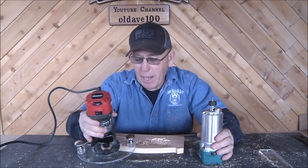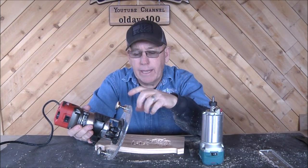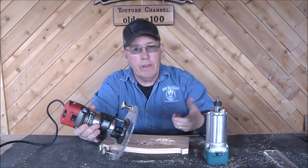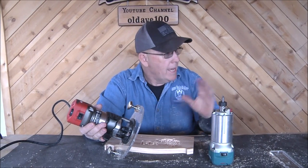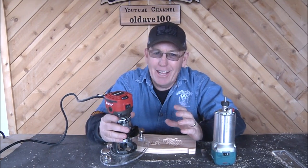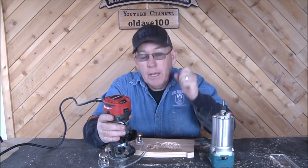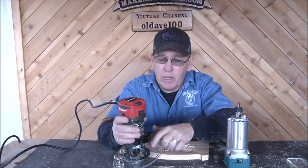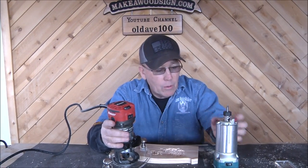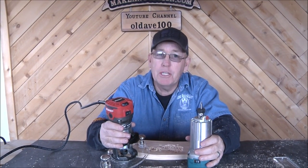The Bauer is a good router. Here's a hint: the more powerful the router, the heavier the cut you want to make with it. If you have the option to have multiple routers, I've got two or three now. I love having a bunch of routers so I very rarely have to change router bits. This 6.5 amp Bauer is where I'll keep my cleanup bit, or if I'm going to do another heavy operation I'll definitely use the Bauer or the Makita, both being 6.5 amp.